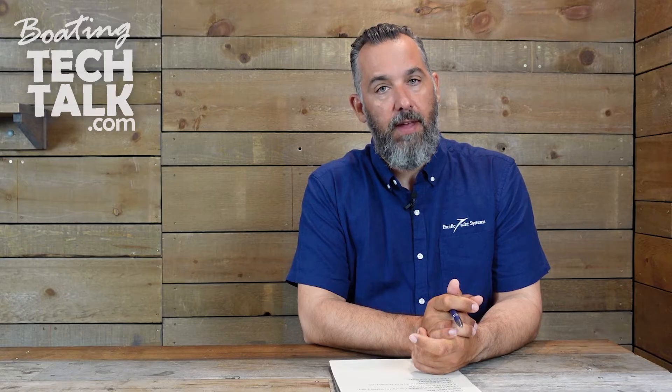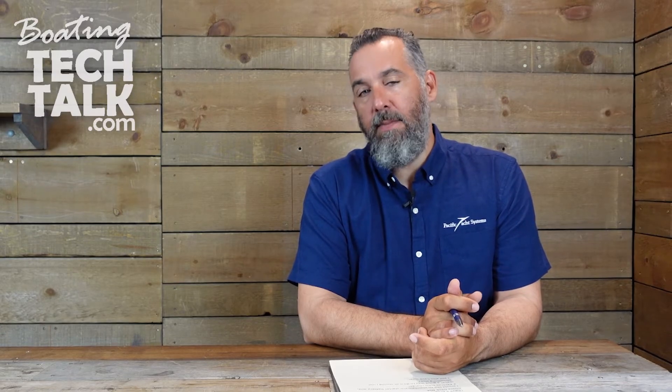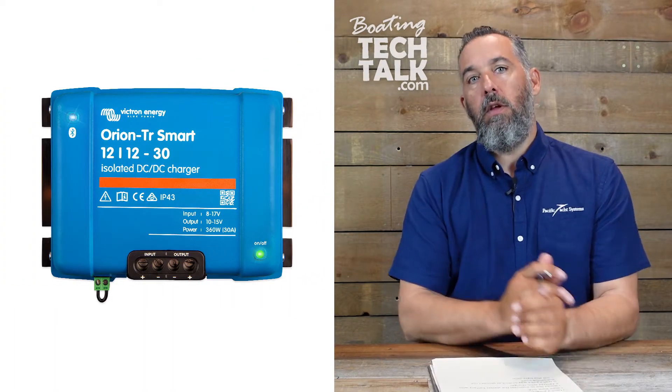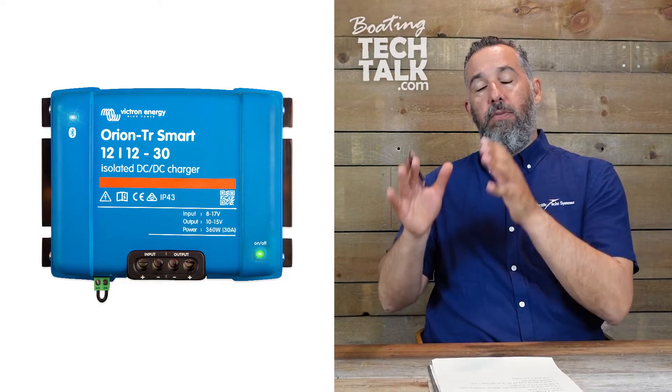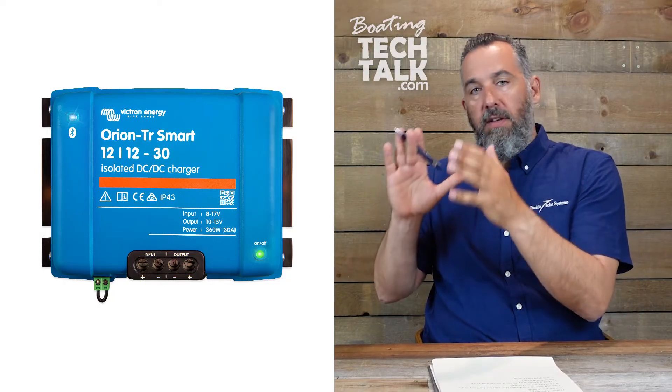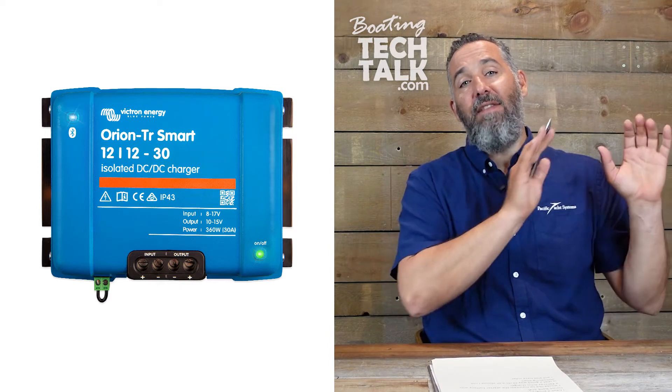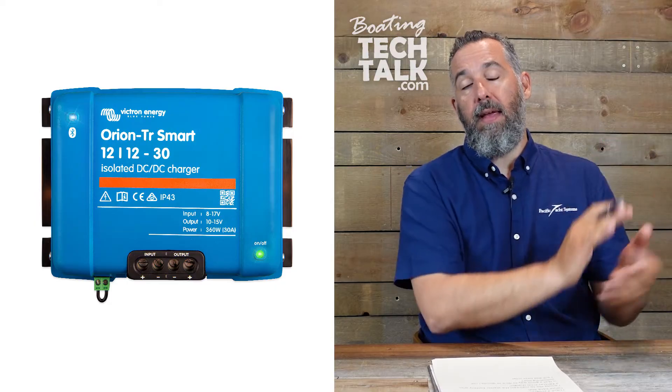If I was Douglas on a Freedom 36 sailboat, what I would probably end up doing is a battery combiner, assuming the battery chemistry is the same. And if it isn't the same, then I would probably use what's called a DC to DC charging converter. This is where you can have an input voltage based on the charging profile coming to that battery, and then literally change and alter that charging profile for the other battery bank. Victron makes those products and they're not that expensive — that would probably be the ideal way.